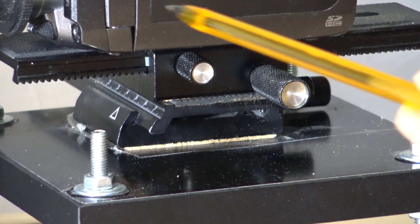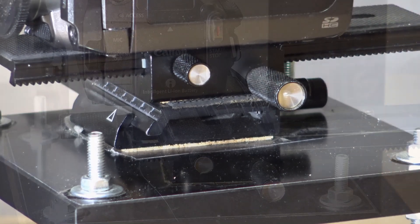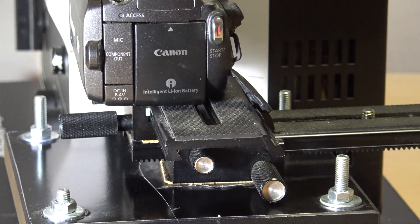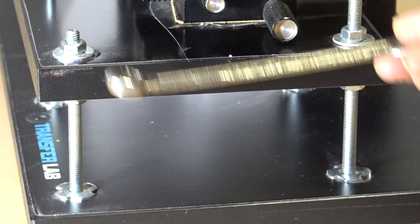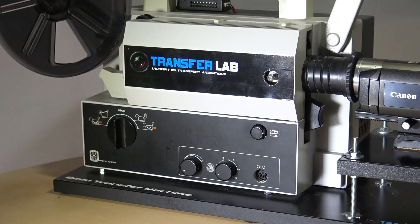You can adjust the camera position vertically using these screws — one adjusts it and the other locks it in position. These screws can also move it horizontally, again one to move it and one to lock it in position. These nuts and bolts move the whole platform up and down. It takes a while to get it right, but persevere for wonderful results.